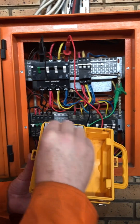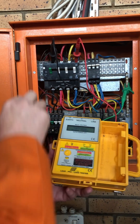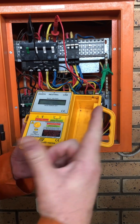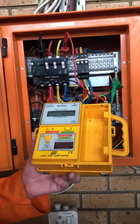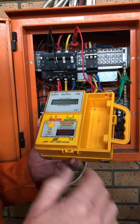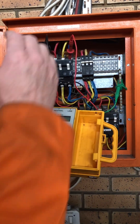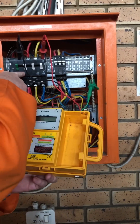When the PSC is more than the breaker rating and you have a prospective short circuit, that breaker is gonna blow up — because it won't be able to handle that spike of amps coming through. Will that happen when there's a load running? Yes. When you get a direct short circuit — so someone cuts the cable — that amps spikes back.